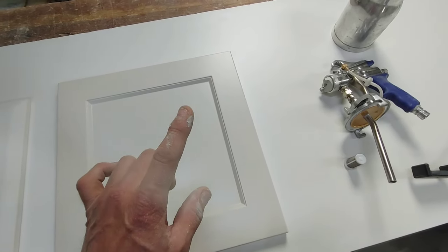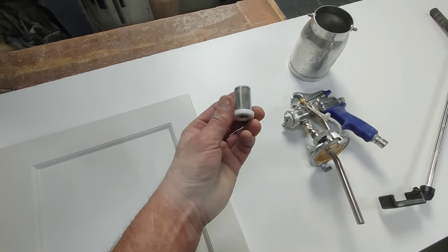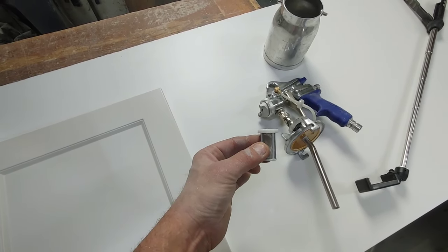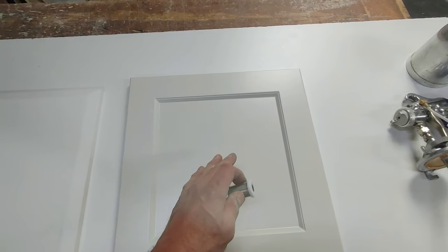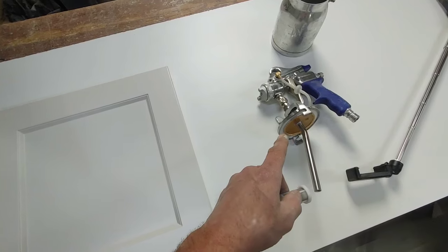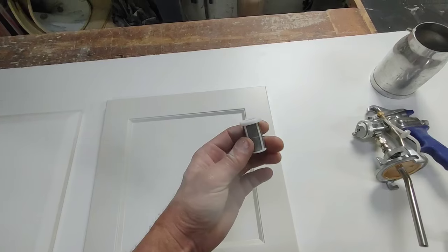If there's one takeaway you can get from this whole video, it's this right here. This will change the way that you spray. It's an inline filter that goes on the end of the gun, with wire mesh on the inside — very fine. It won't allow little chunks of anything to come up into your paint onto your surface. Because the minute you get something that's not in suspension landing on your door, it creates a pit. Eliminating it at the gun will take out probably 90% of your finish problems. If you're getting lumps on your finishes, put one of these on. I can't tell you enough how this has changed my finishing.